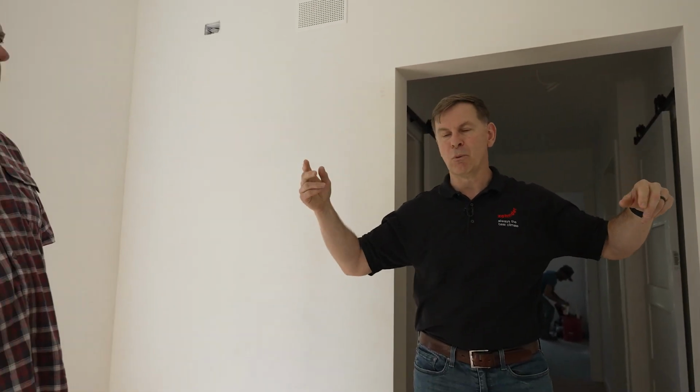But there have been studies just to show, in general, how many CFM of outdoor air one person thrives with. The 15 to 18 CFM range per person is pretty good. So we've just said, in an owner's suite, you probably expect to have two people there. We're going to get somewhere in the neighborhood of 30, 36 CFM. So in order to do that with our tube system, we've just used two boxes. We got one tube to one, two tubes to the other, and we get what we need.